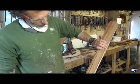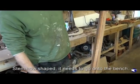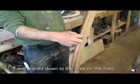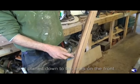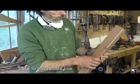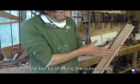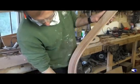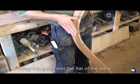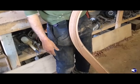There's the stem shaped away on the bandsaw. It just needs to go on the bench and get planed up now, planed down to the lines on the front, back to this rebate line here. Finish up shaping up the top, running that curve in nicely, fairing all this in down here so that we end up with a changing shape from this angle to that flat there where it meets the keel.